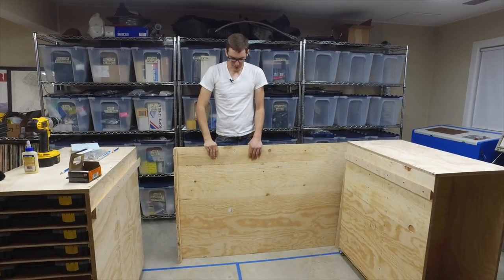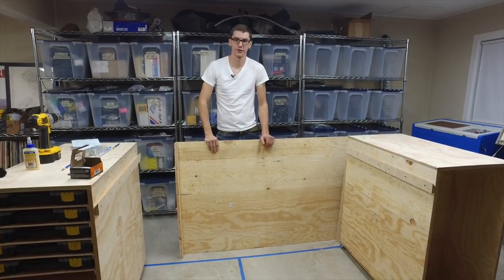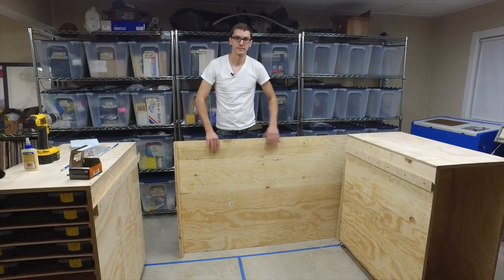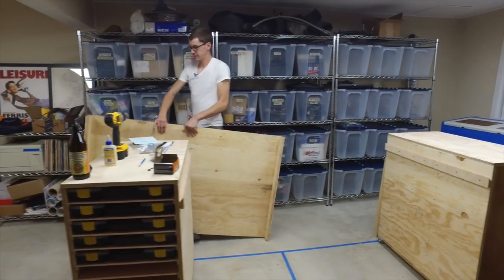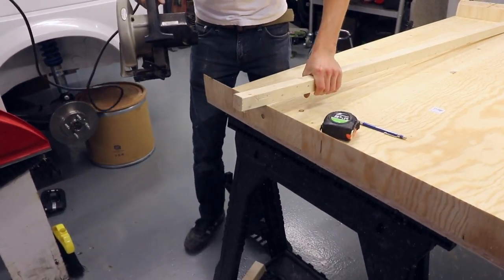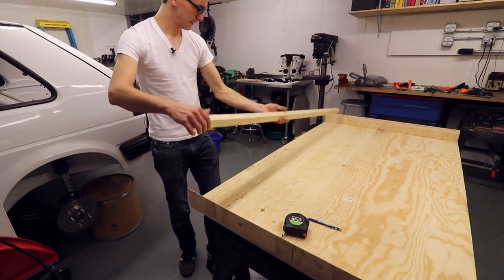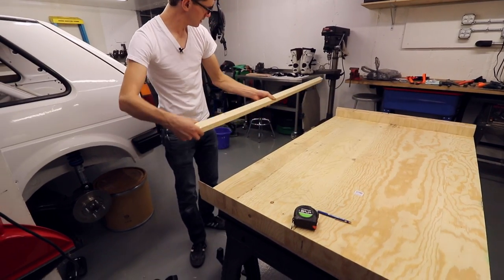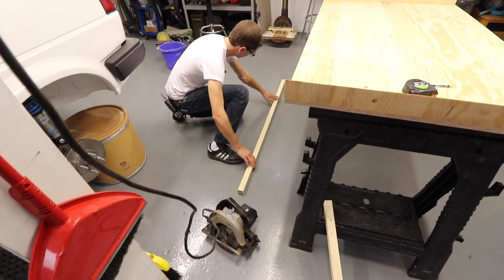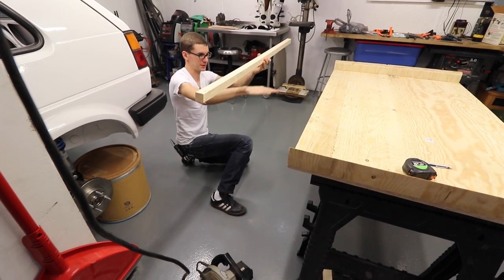So really all we're going to do tonight is do a little bit of reinforcement and clean up on the tabletop itself. I'll take you through the construction process while we work on that. Now this plywood is a seven-ply, three-quarter-inch AC, which is really, really strong, but you probably noticed a little bit of bowing in between. I actually refrained from posting a picture on Project Synchro's Facebook page because I figured someone was going to call me out — are you going to reinforce that tabletop? And yes, I am. We're going to do it right now.